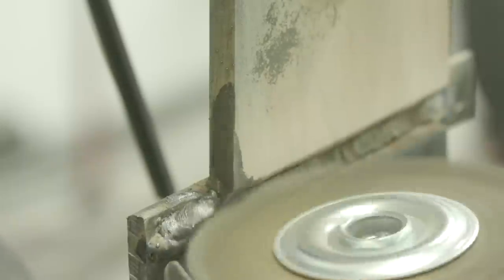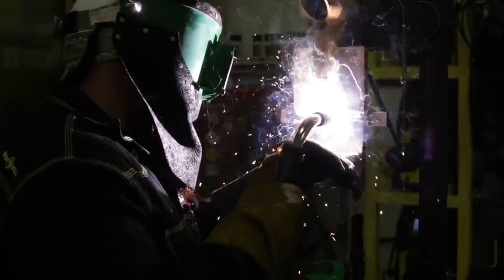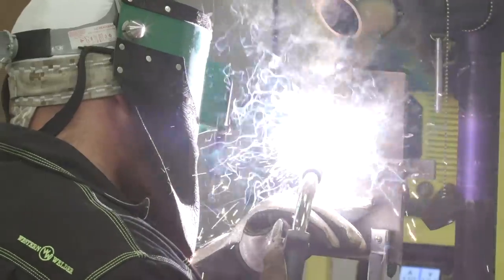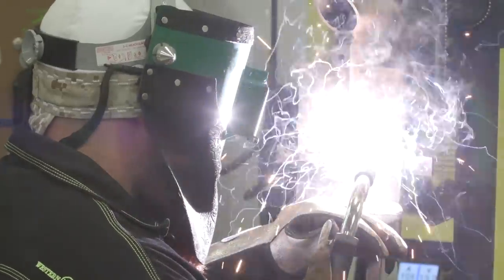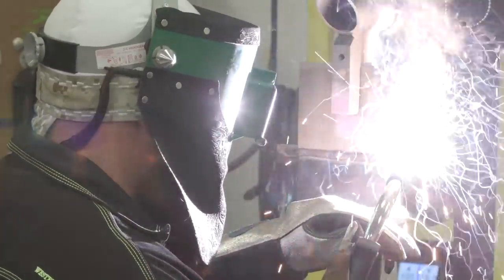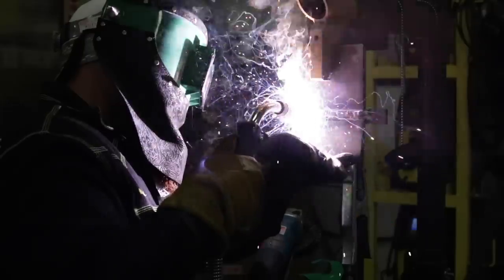This wire lays really flat, so I'm actually going to put two more passes in before I go to cap. Looking down at the joint, I've already put in three welds and I still have a significant distance to go before I'm flush with the plate. So I'll put two more fill passes in — one along the bottom and one on top of that — which should get me in a good position for the cap. This next weld is another fill pass, tying 50% into the face and 50% into the previous weld. For the cap, I'm running a three-bead cap. This is the center bead of that cap — I want to lace into the first pass 50%, then build up a little profile for the third bead so everything goes in nice, smooth, uniform, and linear.